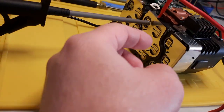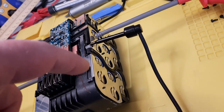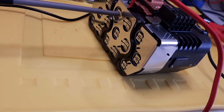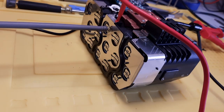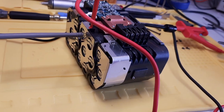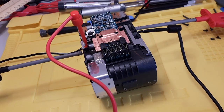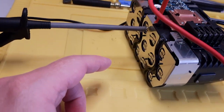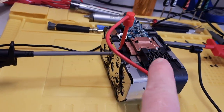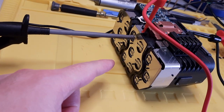It's a matter of these cell groupings — they're grouped in sets of three in parallel, series-parallel. Three cells in parallel, then going in series to the next set of three and so on. Some of those were down to like 3.4 to 3.5 volts. I put it on the charger and the charger would light up green, because some of the cells on the end were like 3.94 volts and it wasn't going to charge all of them. When some cells were already at the target voltage, even though some sets in the middle were only at 3.5.